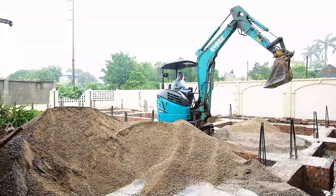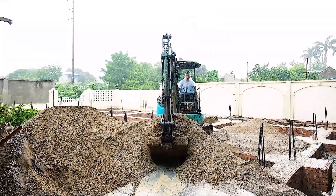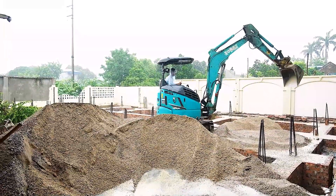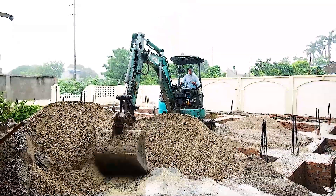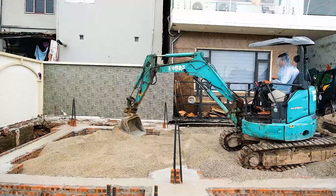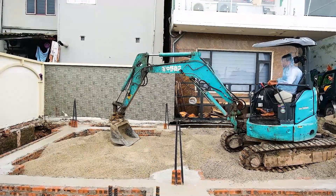Each pit is aligned exactly as per the blueprint. The excavator fills it with heavy scoops. Looks simple, but requires precise control to avoid disturbing the piles. The worker follows up, spreading sand evenly so the fill is compact and stable.